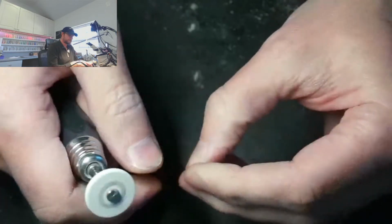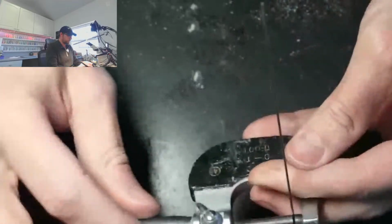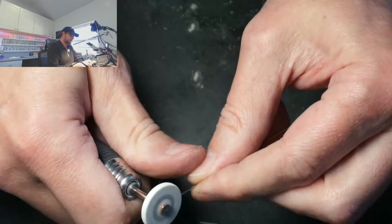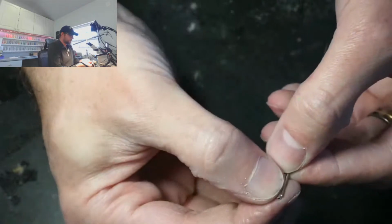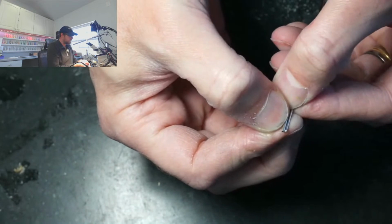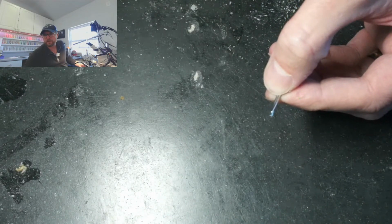And so this side I like to use a thicker wire because I can. And so I'm going to use a 040 wire. Now let me round this off. This is going to be my end, and just taper it a little bit. Let me switch to my PUK cam. But what I'm going to show you, if the PUK cam doesn't show up, I'm going to hold these two side by side like this, and I'm going to laser weld it. I'm saying it wrong. Pulse arc weld it. And then that way, I'll get a nice bead on there, and I'll kind of explain it while I'm going.